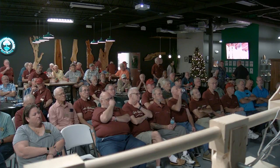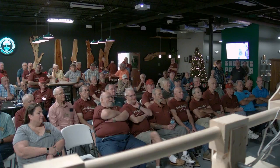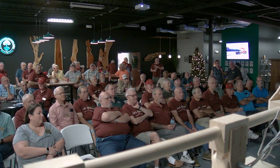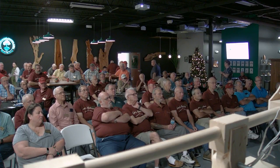That one's probably about 16 inches in diameter. This one was another crotch piece — I mean, it looked hand-painted. When I finished this one in my shop, my wife came out because I was high-fiving myself. Really pleased with it — another piece of Norfolk Island pine. I like Norfolk Island pine. I do a lot of these; I call them my cuddlies. They're the kind of things you pick them up and just don't want to put them down. This was my only piece from Irma — that's a piece of monkey puzzle, about 14 inches in diameter. That's where the pith came together, kind of off-centered the way the tree was leaning. I put a little epoxy with some brass shavings in there and got that flower. Really a neat look.